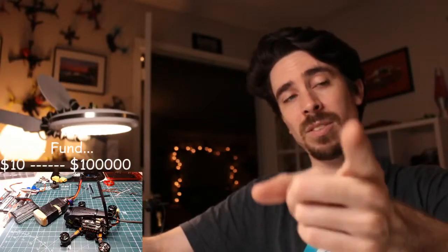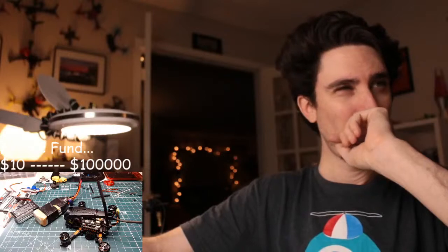So what you want is a 1306. You want an EMAX 1306 4000 kV on 4S. That's what you want. It's going to be either that or a 1404. A 1404 is going to make significantly less power. The only other option I can think of would be a Beta FPV 1505, but you'd have to run that up on like 5S because the KV is too low. So I would do the 1306, 4000 KV. EMAX makes it stateside.